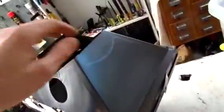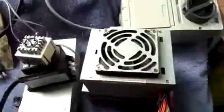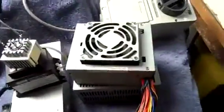You're going to need bicarb soda, quite a lot of it in my case as well. A sacrificial anode. I'm just going to use this old CRT aperture grill since it's clean steel. A lot of it's scrap metal. It's all painted and doesn't really work as well. But I'll just cut that up and flatten it out and just stick it in the tank and have that suspended above it. And you're also going to need a supply of high amperage. I've got these computer power supplies here. I'm probably not going to be using all of them, but I've got them all readily available here in case I blow one up or get water on it.